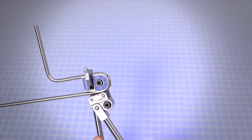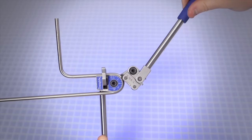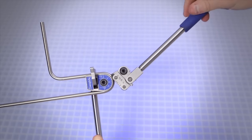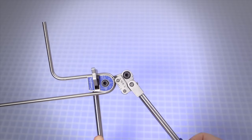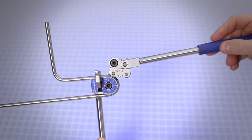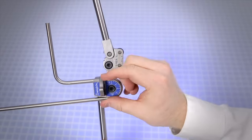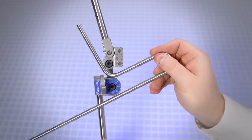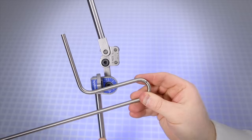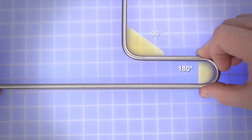After completing the bend, swing the short handle away, pausing when the zero on the roll support reaches approximately 90 degrees. Loosen the short handle, move it until parallel with the long handle, then retighten the short handle. Move the short handle up and away from the tube. Pull the tube latch off the tube and remove the tube from the bender groove. Verify the bend angle using a template or against a known angle to ensure the desired bend angle has been achieved.